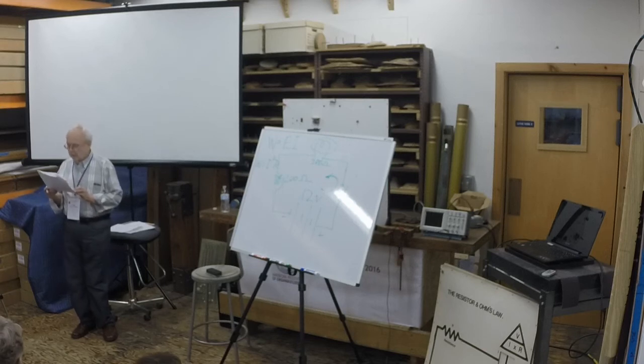First of all, you have to decide how much voltage you're prepared to lose. This is what Bob was referring to: how much voltage you're prepared to lose between the rectifier and the solenoids. It's a trade-off, like everything else in organ building, between size and money and lost volts. The bigger the wire, the more expensive, the less voltage lost; the smaller, well, you get it.